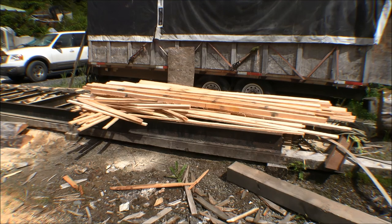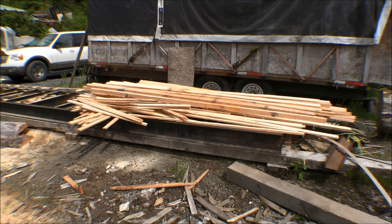If those are 10 feet long, and I stack my piles up 4 foot deep, these stickers will be cut in half, so that'll double them. Well, that gives me a pretty good number of stickers there. Anyway, like I said, they're not very good, but they're better for stickers than they would be to try to make lumber out of them, and they don't make firewood worth a damn, so that's spruce.